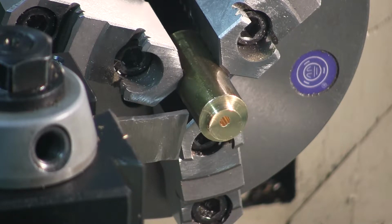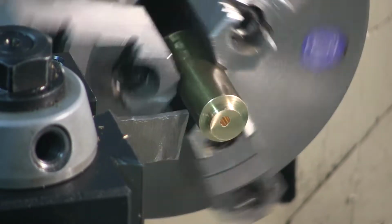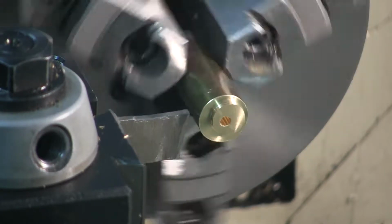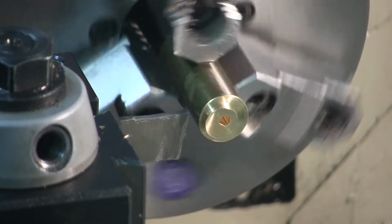I did that, but I screwed the first eccentric up by having my offset wrong. So I'm going to have to drill and ream that hole a little deeper when I go to build the spacer. So I'm going to turn this at 70 RPM and power feed it at 0.00168 inches per revolution.